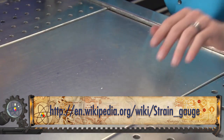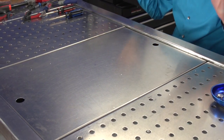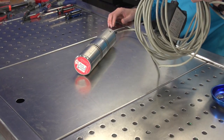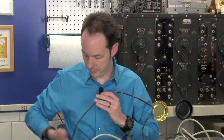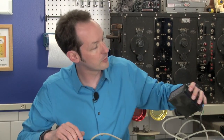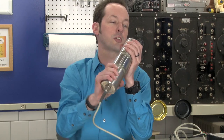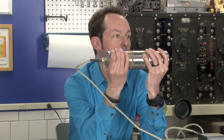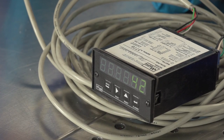So let's get all that out of the way. If little load cells are cool, remember how I told you later in the video I would show you a big for-serious load cell? This is a for-serious load cell and we've got it wired up. But to make it work, it has to be suspended in a very certain way. Because this is measuring shear load. You can see we've got numbers there. And this is designed where you hang it like this — it's held on the two ends and then force in the middle. When I press down on the middle, at rest we're at 29, but if I press, now we're at 42.